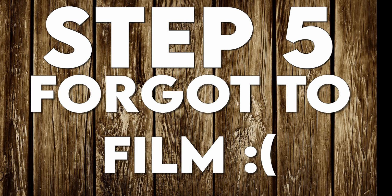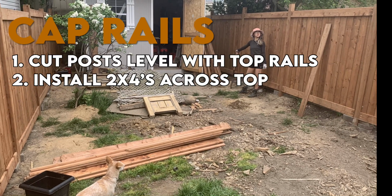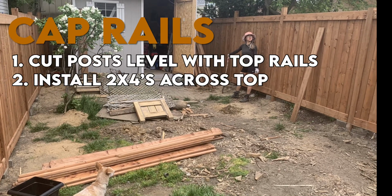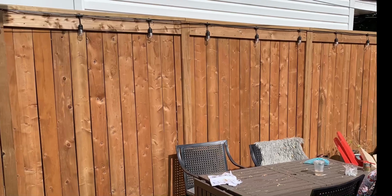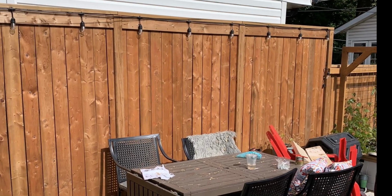Sorry, I started to get impatient near the end. Cap rail is an easy process though. We just did 2x4s all the way across to protect the end grain from water entry. You can see the cap rail here. It really helps provide a finished look to the fence.